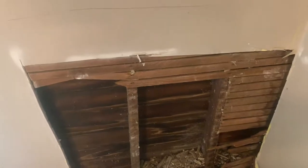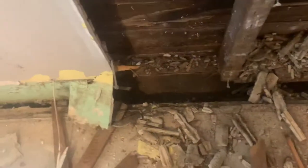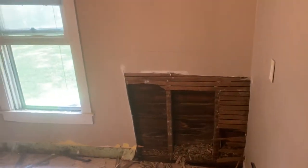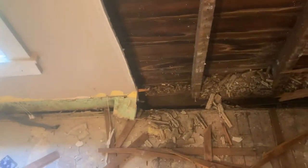We've cut back under it. They put sheetrock over the old plaster boards and we busted that out. The base of the wall is leaning out. I think what we're going to have to do is cut all the sheetrock off this wall in both rooms and then reframe — we'll have to brace the ceiling up. I'm not a construction expert, so I'm going to get a lot of opinions, but we're going to do some of this work ourselves.